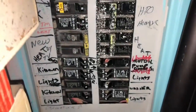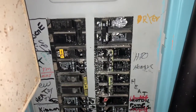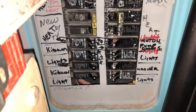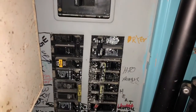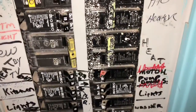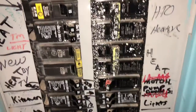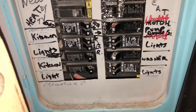Having said that, this is a small house, and here is our switchboard, right? Circuit box, whatever. So the 220s, like this thing is full. I would have to add a sub box with double 220s. So I could use the hot water heater, 220 there. That's the dryer. This is the heat, electric heat into the house, range. So, yeah, do I want to hook up a sub panel in the basement? And even hiring an electrician, I could hire an electrician, but that's going to cost a lot more money, and that's also going to take time.